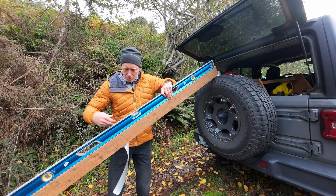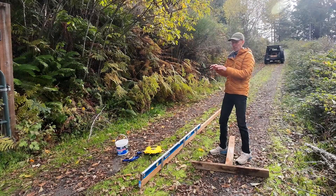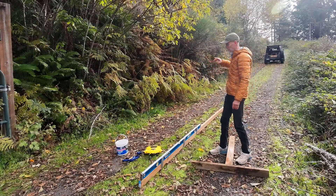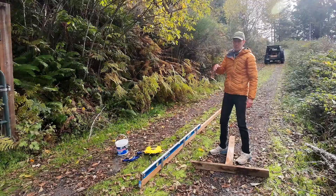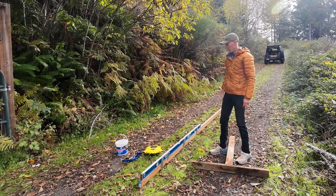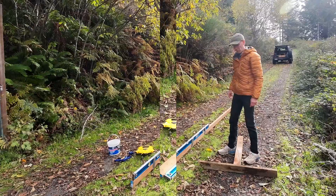I'm going to measure the rise versus the run, and I'm going to enter that into my computer every 50 feet, measure my way up to the property, go over the hills, and then I can assess the grade and build a graph that I can use when I'm talking to the fire department.